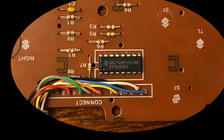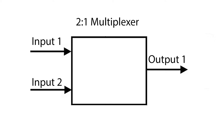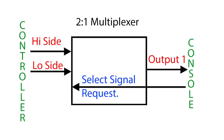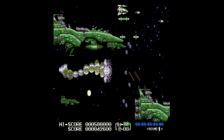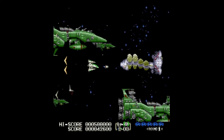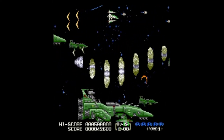This is accomplished using a 4-connection 2-to-1 multiplexer chip. In simple terms, this chip allows 2 inputs to be sent via a single output. Inputs are assigned to a low and high side. The Genesis sends a request via the select signal asking what buttons are currently pushed on the high side, followed by a signal asking what buttons are currently pushed on the low side. It can take as little as 20 microseconds for an inquiry to register an answer. The cycle of requesting the high result followed by the low result continues until the system is powered off.